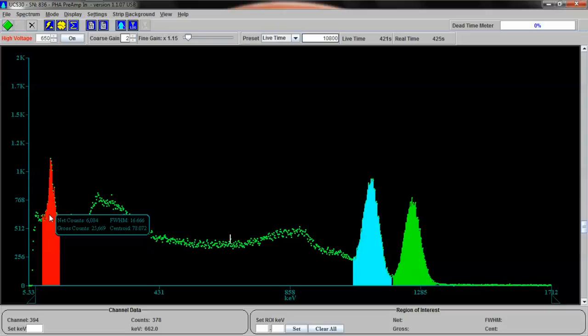This is actually X-ray fluorescence. You know, like when you shine a black light against something that's white and you see that shine that comes back at you? Well, what's happening is these powerful gamma rays are hitting the lead shielding and, well, they don't reflect back. It's actually fluorescence. The atom releases X-rays that are around 75 to 80 kiloelectron volts, and here they are. This is actually caused by the lead shielding. Isn't that amazing? As a result of this, you can actually shine the cobalt-60 against an object and look for this peak, and you could determine if objects had lead in them using this, or any other element for that matter, because all elements emit characteristic X-rays as a result of high-energy bombardment. This is called X-ray fluorescence. So that's what this is right here.